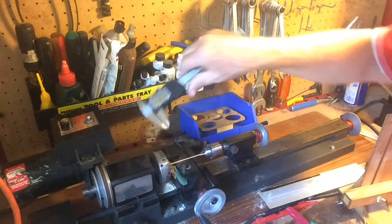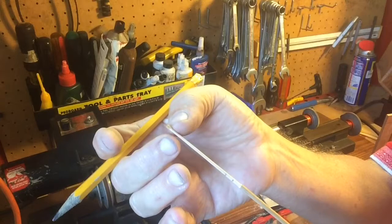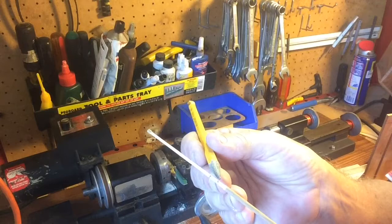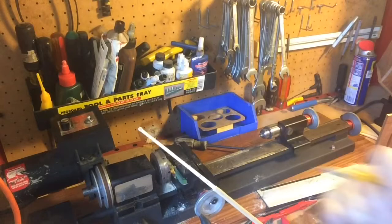So this gives you a good idea of a scaling bar. You really need to start, if you're using the lathe, and come back down this way. So these are the two marks here. We're going to take this down, and then we'll eventually cut it off here. That takes all the stress off of this when you're grinding it down. Otherwise, she'll simply break on you. I'm going to take it down first using the lathe.